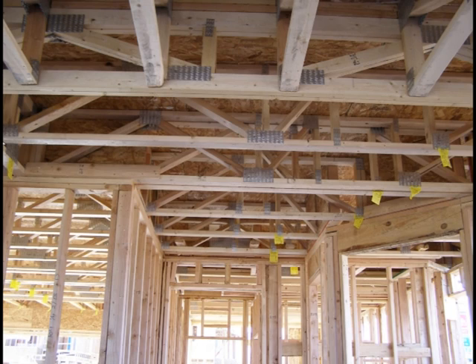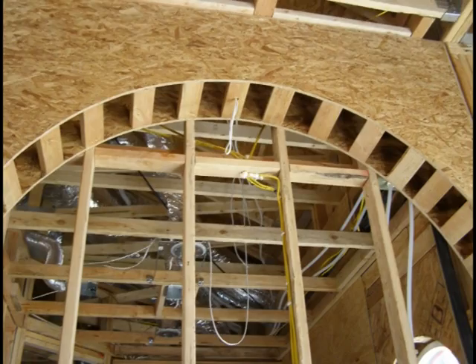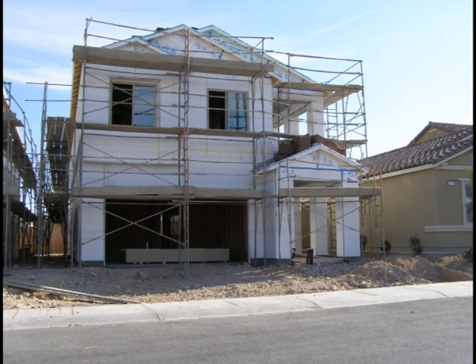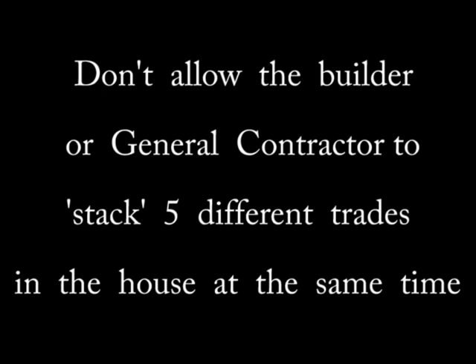Here is a really good example of a fully framed house ready for plumbing, air conditioning, and windows, but not for wiring. Your time frame is very short and you have to be on top of the situation. You want all of the above to be complete, but you want to finish before the house gets to the point of lathing, or especially stucco. Installing service outlets on a stuccoed house is a major time killer.